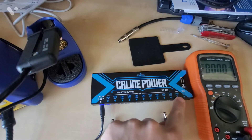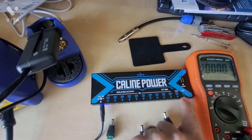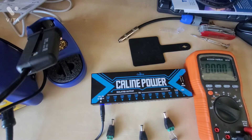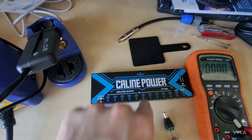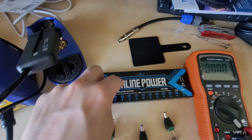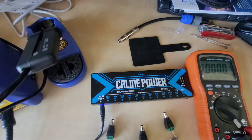So we're very close. You have the 12 and 18 volt lines taking up whatever's left of that 2200 milliamps — so 2200 milliamps on the 9-volt lines, then 800 milliamps left at 18 volts to power the other outputs. At different voltages you'll get different currents when derived from the 18 volts. You're getting very close to that 1.5 amp output from the wall. There are going to be losses with the transformers, switching frequency, and diodes, so if you get 1.5 amps in, you may get 1.4 or 1.3 amps out — that's actually pretty good.